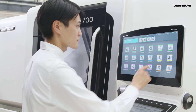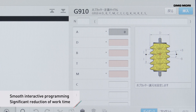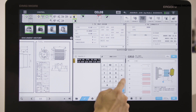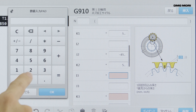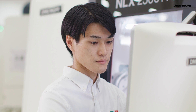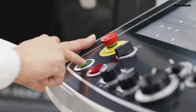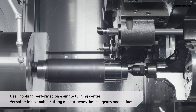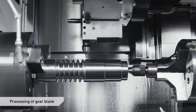Creating a program is very simple. Setting specifications like the gear diameter, number of teeth and module is performed interactively. Also supported is more detailed setting of the machining conditions by skilled operators. Drawings can be checked directly on the CELOS operation panel, enabling smooth and easy setup. The entire process from material loading to gear cutting is performed on a single machine, shortening setup time while improving machining precision, with no space needed for gear blanks or work in progress.